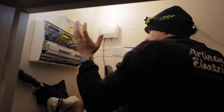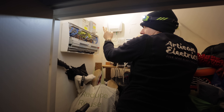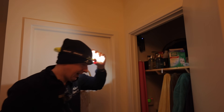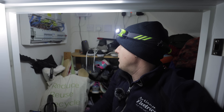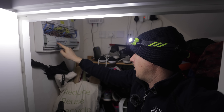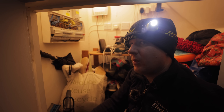We've narrowed it down — that's what fault finding is all about. Just for fun, we turn the upstairs AC isolator back on and then turn the circuit back on downstairs. There we go — it's tripped the RCD, not the MCB. That indicates an earth leakage fault rather than a direct short between live and neutral. So there's an earth fault on one of the micro inverters — we'll likely need roof access equipment for further investigation.